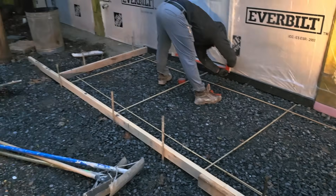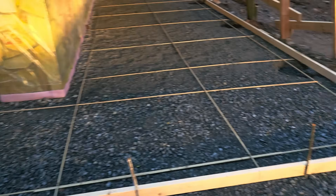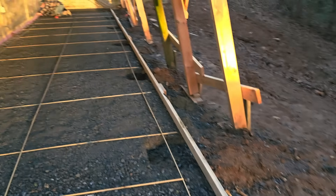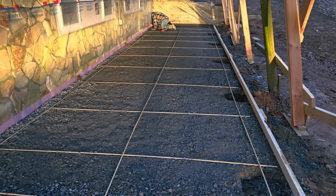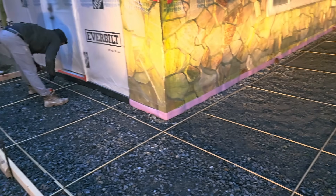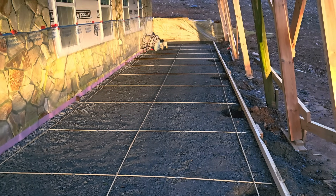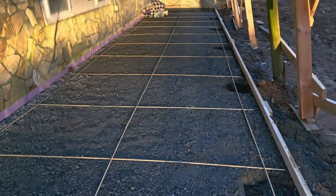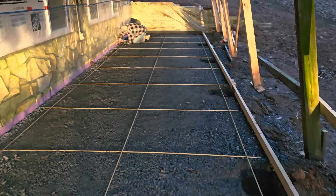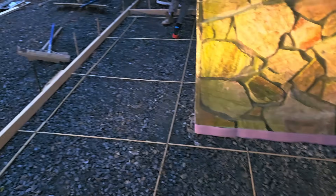Shiloh's taping the threshold. We went with straight cement, hot water, and one percent non-chloride accelerator, so this stuff should kick. It's close to 30 right now but should get up to about 65 degrees today. My prediction is we'll be broomed and out of here about one o'clock — we'll see.